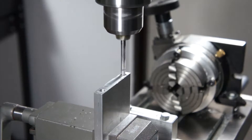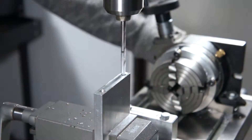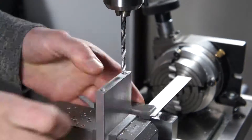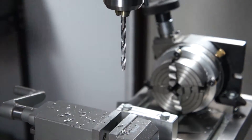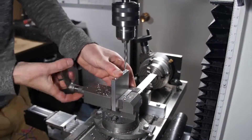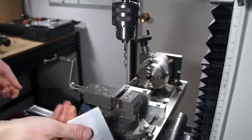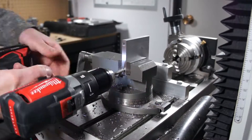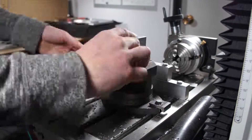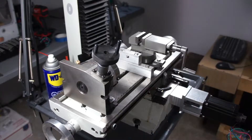The next step is to make the standoffs for the x-axis. Here I'm just using some plate. I could have done this with rod and mounted it to the little brackets, but I like the plate and it kind of seems to protect the couplers, keeps the grit out of them. I'm eventually going to make little steel or aluminum shrouds for the steppers, but this will work for the meantime. Low tolerance part so I'm just throwing it in the vise and using my little square on the back to keep it in relatively the same position. Hand tapping — rigid tapping is the way to go, but for this the bolts are going into it and there's room for adjustment so I wasn't too concerned.